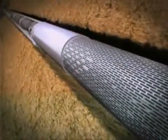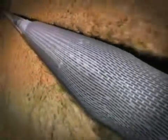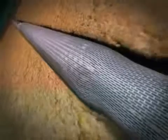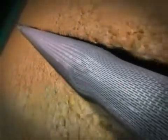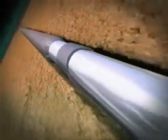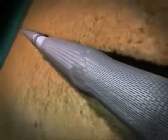The expansion BHA is now positioned above the first ESS joint. Flowing at a lower rate provides sufficient back pressure to expand the ESS joints. At this point, the diverter isolating valve does not function and the pressure acts on both expansion tools. Again, expansion is achieved with rotation and forward movement. During this process, the expansion rollers retract, passing through the unexpanded connections as progress is made.